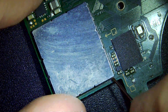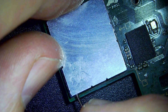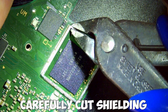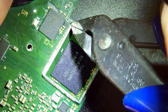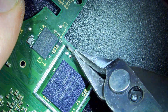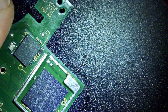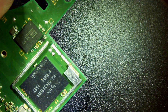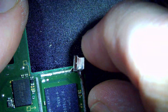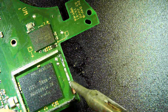Use a pin to remove the heat shield on the back. A lot of people say you can insert the adapter without taking this section off, but I prefer to remove it. Just be really careful with wire snips — you don't want to cut further down and rip any traces from the board. Cut what you can, gently wiggle it off, then remove the back bar. I've also found it easier to remove the corner section as well. Add a little bit of flux and solder to clean it up and make sure it's nice and smooth before putting the adapter in.